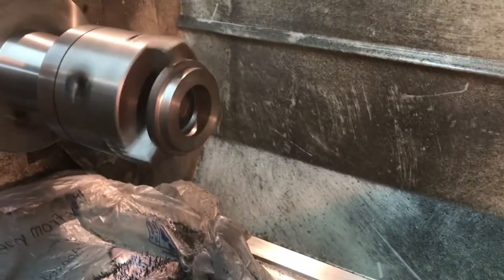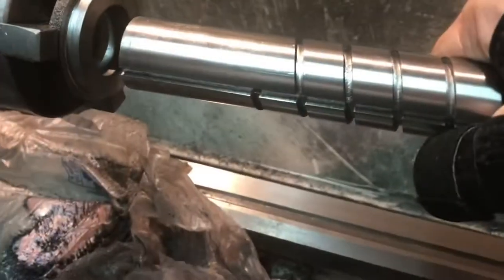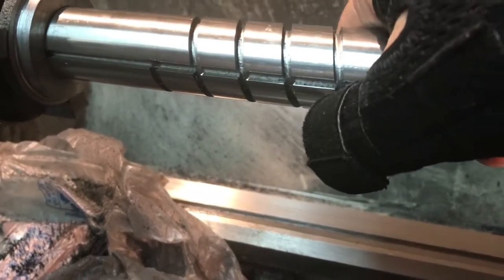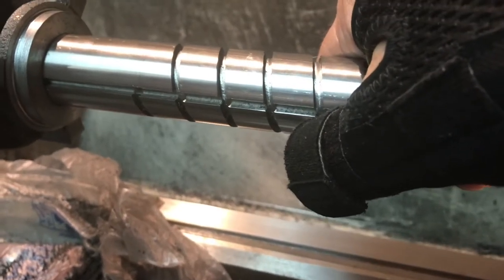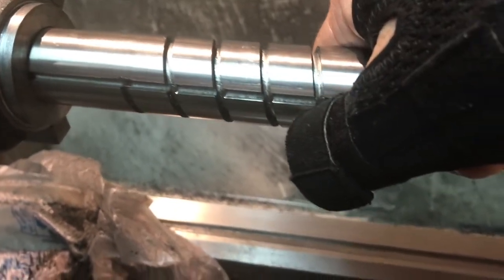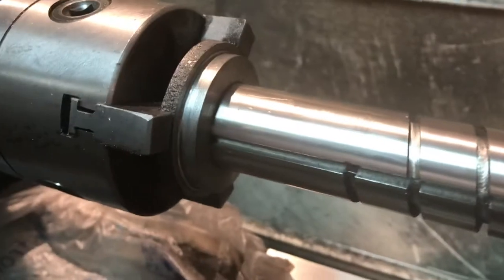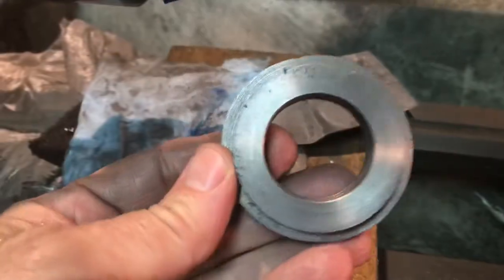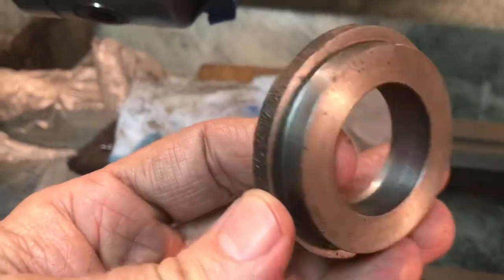Let's test the fit. It was a little snug, so I took a spring pass without adjusting the cutter at all, and now it just fits fine — a nice sliding fit. There should be plenty of room for the little peg and the nylon snubber. You don't want it too tight.